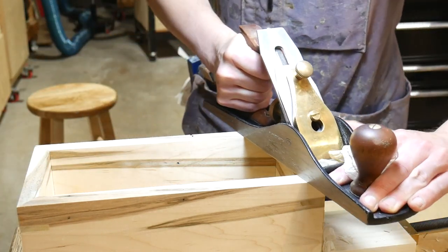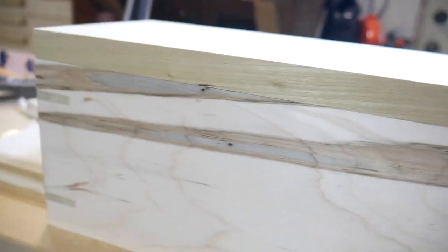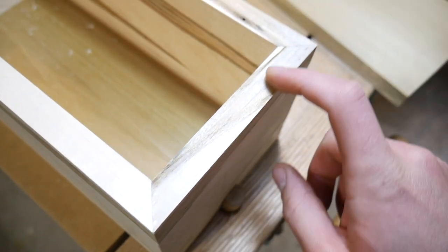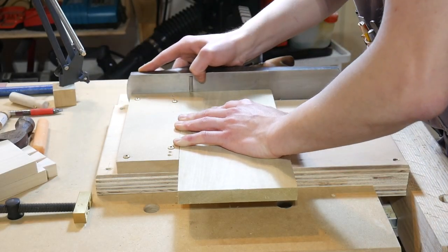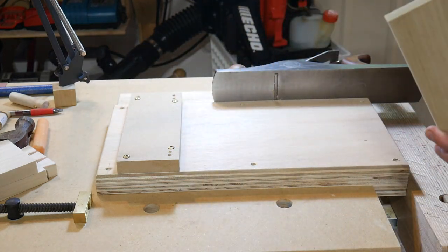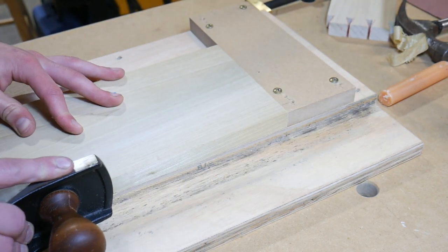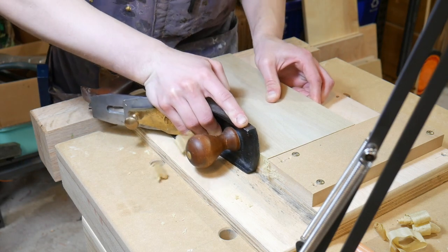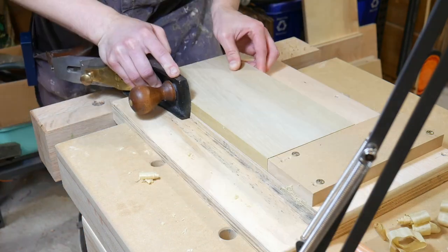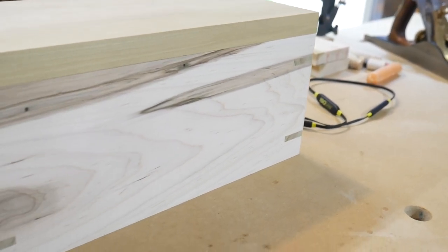I take passes and go around each corner to make sure I'm not cutting across the grain, and after about 35 minutes of working on that you can see the box top fits perfectly flat and is nice and smooth on the top ridge. Next I work on fitting the lid using my shooting board. The shooting board method allows you to perfectly dial in the fit — if anything is off square on the box you can compensate on the lid by taking partial passes along one edge. You have to keep a little pressure against the plane for pieces longer than they are wide, and I just continue until the lid is perfectly fitted, flush on all edges with crisp corners.